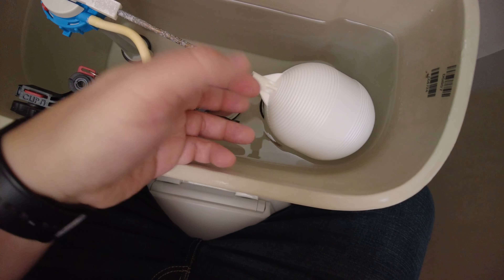As you can see, if you push the float down it fills up the tank faster, and as it goes up it slows down, and if you pull it all the way up it stops. What needs to happen is you either need to adjust this or bend the rod so that the float sits lower — ideally about a half inch to a whole inch below the top of the tube. Even though that's the issue with this toilet, I'm going to swap out the fill valve since it's an older model and I'd like one that's more efficient. I'm also going to change out the flapper while I'm in here, as those are two of the most common reasons for a running toilet. I'll show you how to do that step by step.